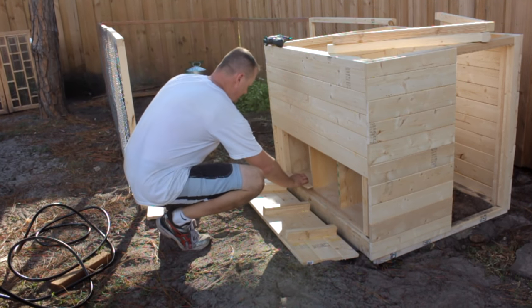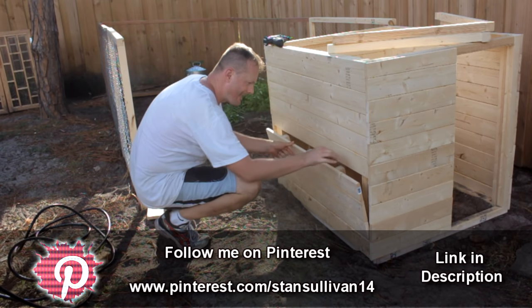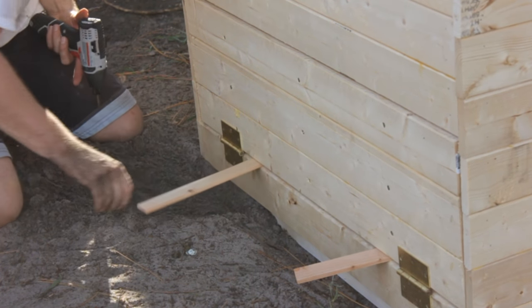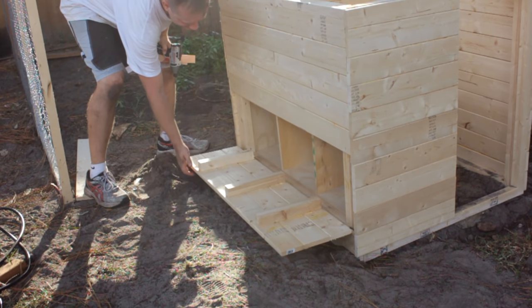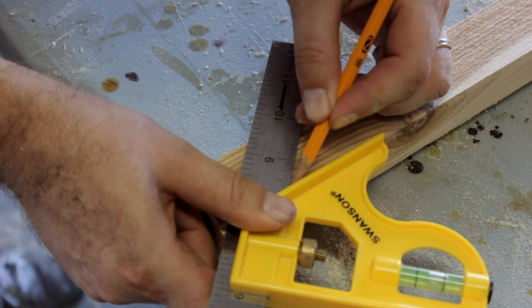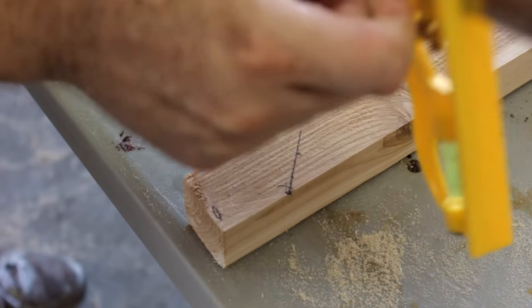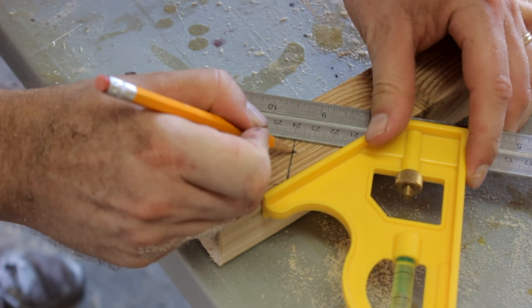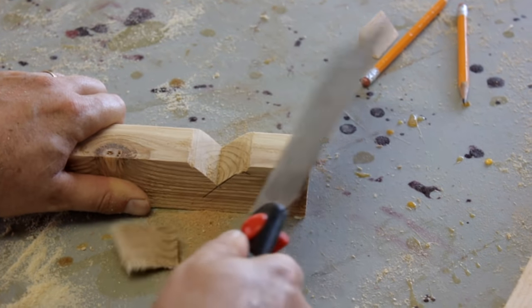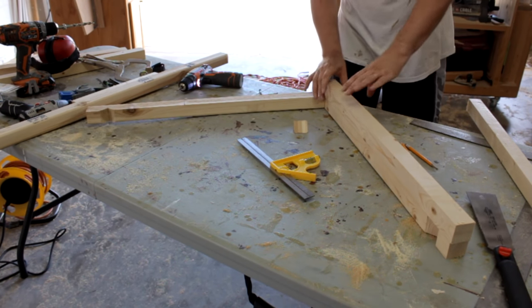To install the nest box door, just set some spacers first, then set the door on the spacers. Now for the roof — everybody knows how to cut a bird's mouth in a truss, right? Don't worry, I'll have all this listed on my website simplyeasydiy.com. Measure up to where you want the bird's mouth to start, mark a 45-degree angle, flip it around, mark another 45. Then have at it with a jigsaw or a hand saw. Once you get the notches cut on the first one, you can use that as a template for the second.